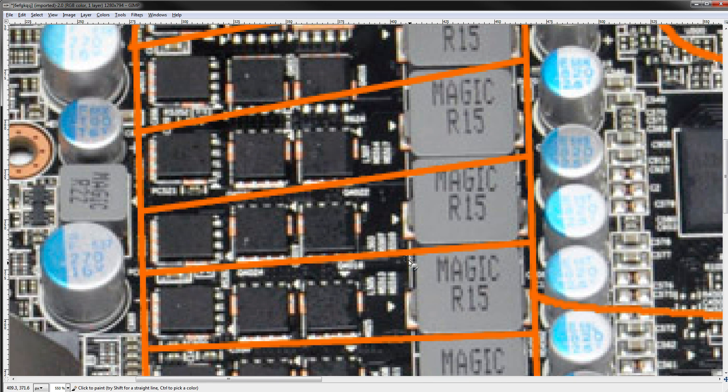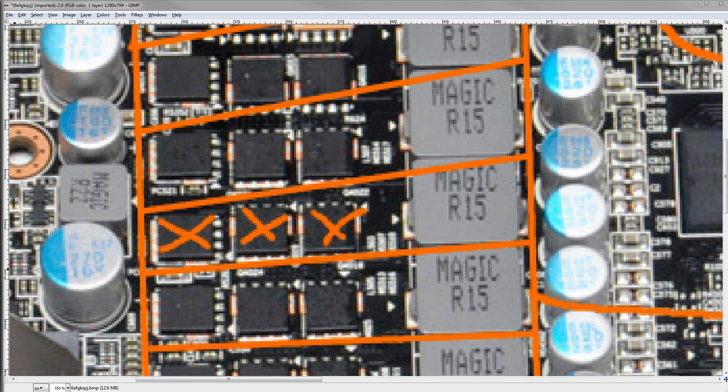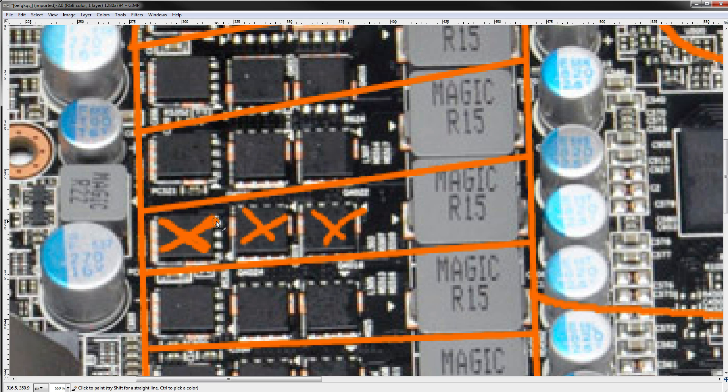Let's look at what actually makes up one of these six phases in the core voltage. You have two low-side MOSFETs and one high-side MOSFET. The high-side MOSFET is usually the first to go in a VRM because it handles the highest peak currents. Gigabyte opted for a high-side MOSFET rated at 30 amps at 100 degrees case temperature — and this is worse than the AMD reference design.